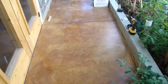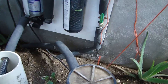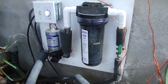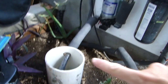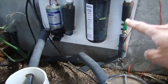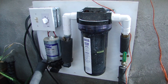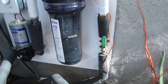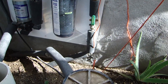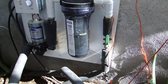I should also mention what that was doing. I wish I had a video of this — it was disgusting. All that muck was getting caught in the filter going back to the toilet. So when that graywater gets pumped out of the end of the planter, it goes through this filter and then out to the toilet, and this thing was just mucked up like dead black — it was gross. You can see here the filter is nice and clean; I just replaced it a couple of days ago. Hopefully by getting rid of that filter fabric in the reception cell, that should also make this filter last a lot longer.